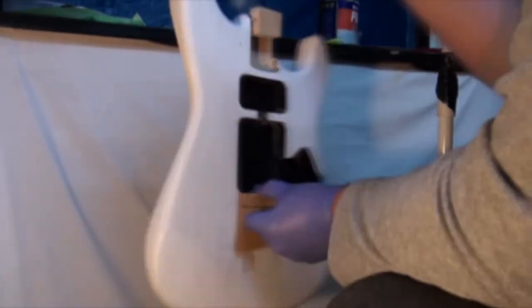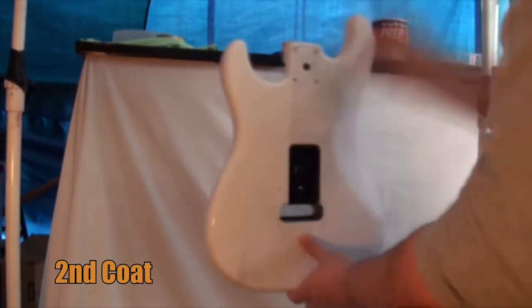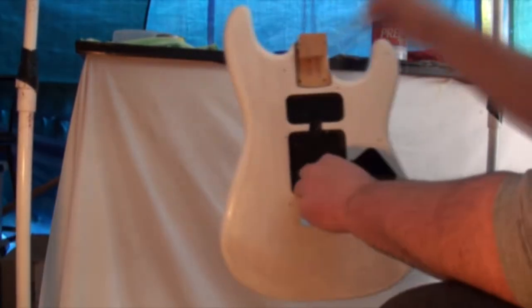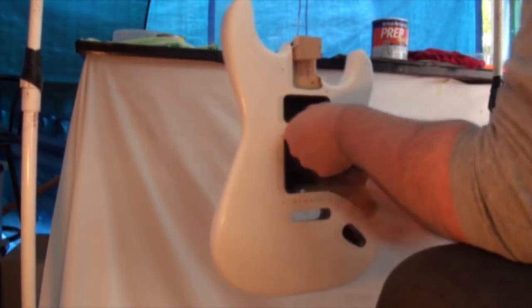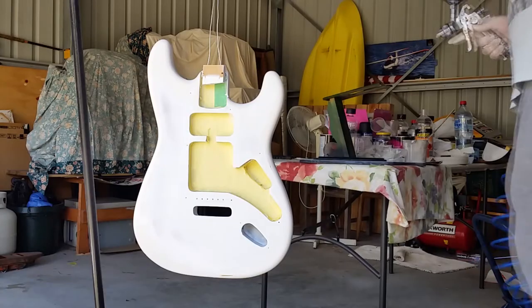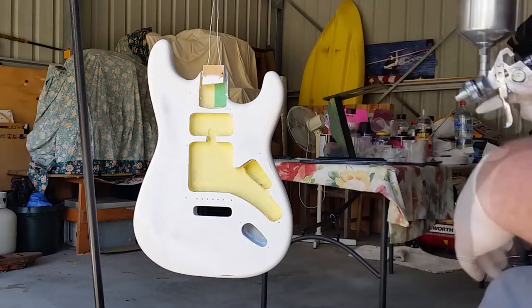At this time, I really hadn't figured out the benefits of either using water-based or oil-based undercoat paints. In this case, I bought the oil-based paint simply because I wasn't really paying too much attention when I was at the shop buying it. So since this primer was oil-based, I had to stick with non-water-based paints moving forward. I applied two coats with a paintbrush, then I wet sanded it smooth, maybe up to 600 grit.